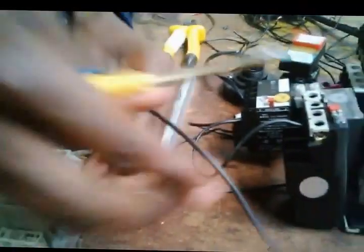So it's tight enough. Then I go to 14. Right, when I go to 14, I need a cable from 14 which goes to the normally open auxiliary of contactor A. The normally open at the same time goes to the normally closed of B, the auxiliary.